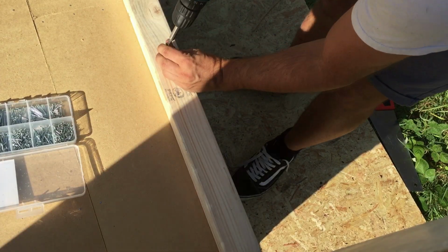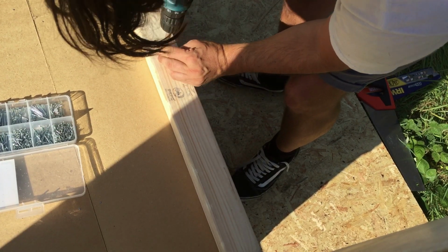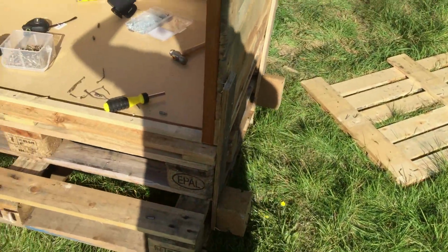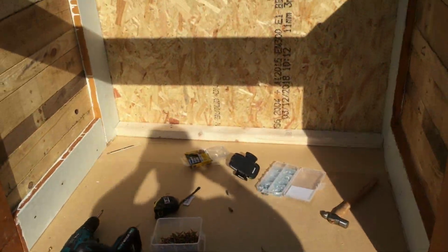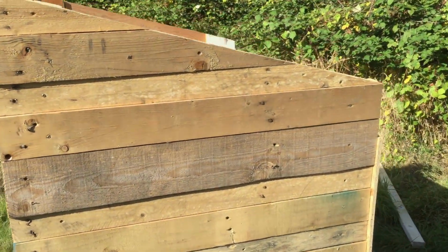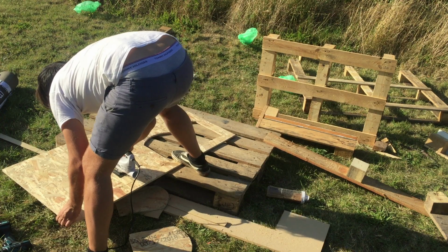I added a beam at the back so that it can provide structural support when we hang in the roosting box. For the entrance to the roosting box, I screwed in a piece of chipboard and drew on 4 rough sketches of entrance points and then used the jigsaw to cut them out.